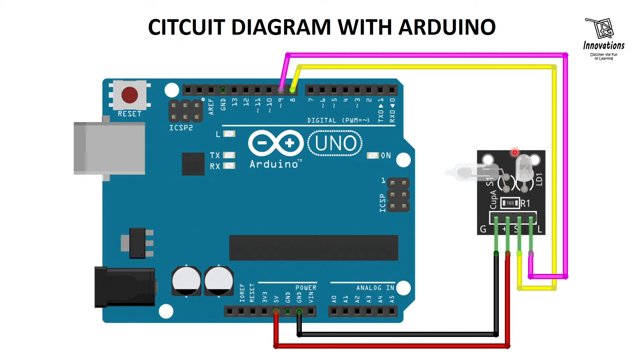Using this circuit, we will see two projects. The first is to simply check the output state of the tilt switch — whether it is high or low — and based on that, the LED will turn on or off. The second project implements the magic cup effect: when the module is tilted, the LED will fade out, and when the module is reverted to its original position, the LED will fade in.